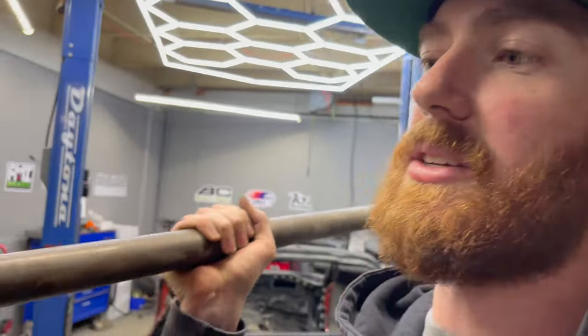On the main hoop you can see where the half-laterals and backstays are going to go — Rob's machine etches those on so you have no chance of missing where the tubes are landing. That's a really important feature because if the tube is off up or down on a main hoop that's leaning back, it changes the length or distance from its point to the landing point, and the whole cage can be thrown off.